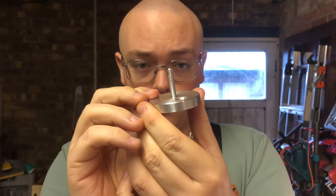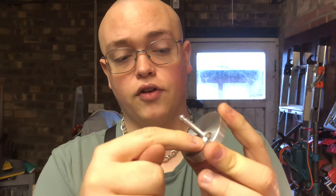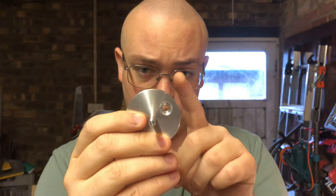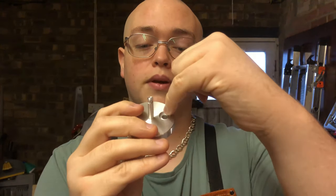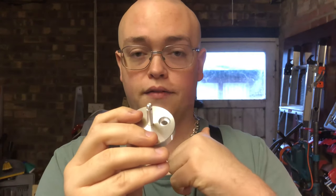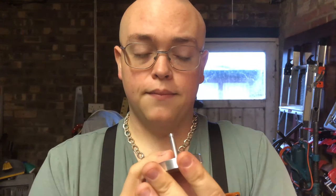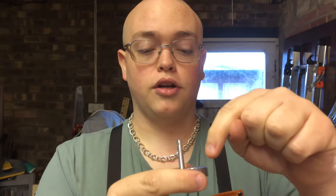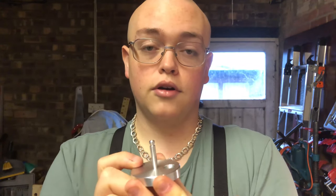Now, it's almost done, this prototype. The only thing I've got left to do is I've got to make this hole here square at this 6mm size. And then the top feature there, that counterbore, needs to be a square and flat-bottomed counterbore rather than conical as it currently is. So, my plan is I'm going to make use of the mini mill and I'm going to put this on a rotary table and use a small, probably 3mm end mill, and then cut this round on the rotary table.